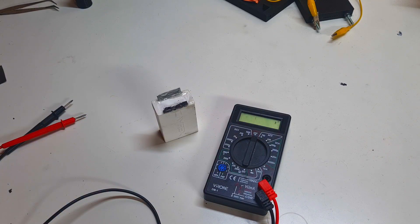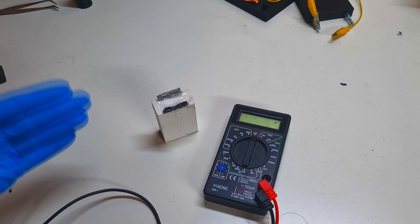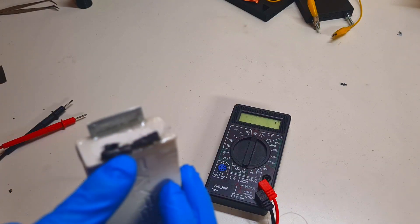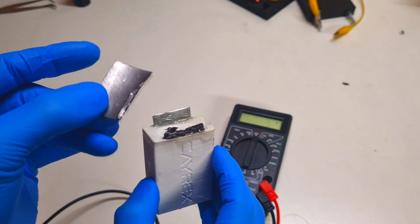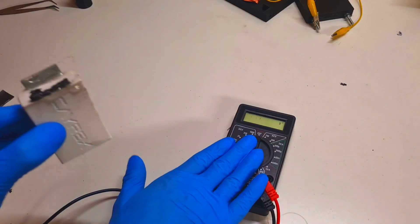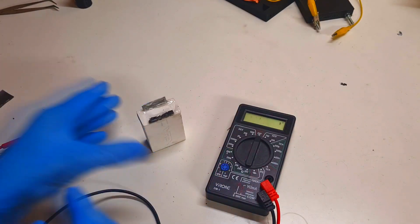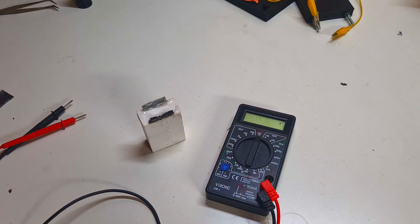The point of this test was to see the self-discharge rate of this zinc manganese battery after 30 days. But clearly I forgot to make a video when the cell hit 30 days. On the first 20 days I measured the voltage almost each day. You can also see how badly I damaged the positive current collector. The positive current collector used on this cell is made from graphite foil, and just testing with the multimeter each day for 20 days almost completely destroyed it. So using graphite foil for the current collector over a longer period of time is not really good.